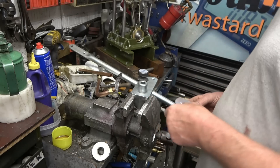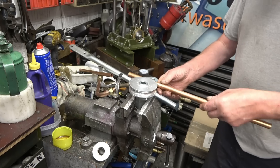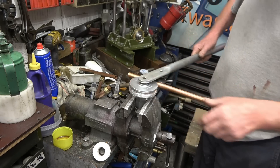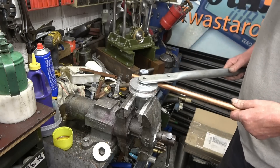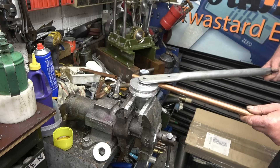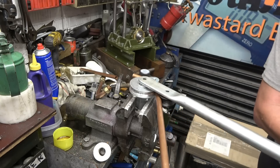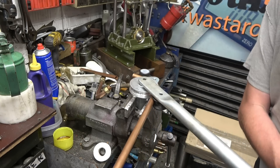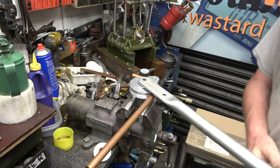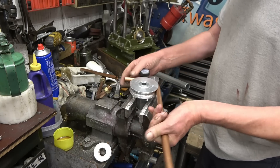This is the bender I've borrowed. That's a five-eighths mandrel that goes onto there, that goes into there, and this is the handle that does the bending. So I want a straight bit and then a bend. I'm not quite sure which way or how this works. It should bend without kinking because it is really heavy wall pipe and I want a nice 90 degree bend in there.